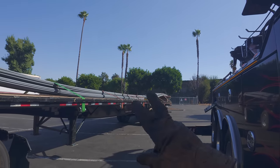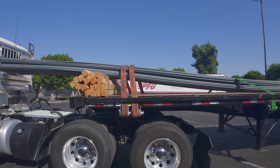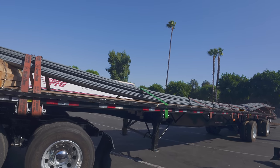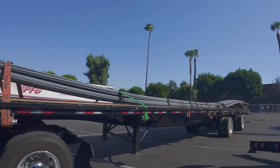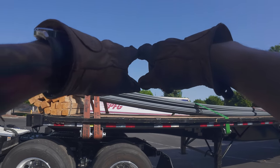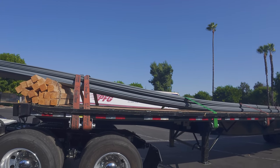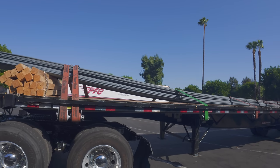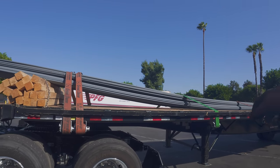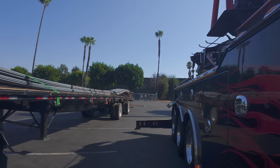And the reason we're using two trucks is simple. It's rebar. It's not like steel pipes or something that's 100% solid. It's bendable. So if I use the truck with two lines like this and you just pick up, you're not gonna be able to lift up the whole thing. If I lift from the middle, the ends stay on the ground. If I just lift up from here, then that end stays. It'll make a lot more sense once we go airborne.